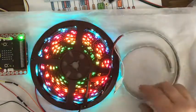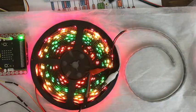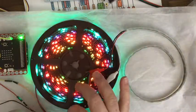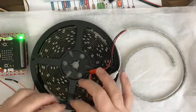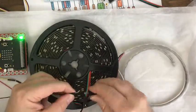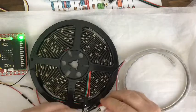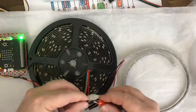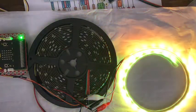I'm going to plug in this tiny strip. These are NeoPixels. Important thing: there is an order you should follow when plugging and unplugging — always unplug power first, plug power in last. When plugging in, plug ground first. Don't plug in power without a ground. So: ground first, then signal, because that's the information the strip needs to know what to do, and then last plug in power. This is a smaller strip of only 30 LEDs.